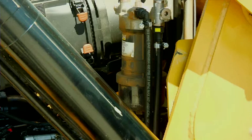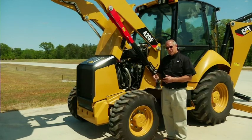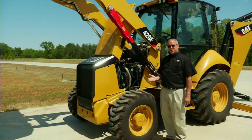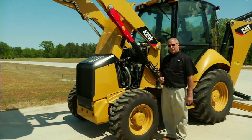and now the water separator's there and you've got easy access for draining the water out of the fuel system. In addition, we've gone with this engine with an electronic fuel priming pump. So now there's no more manual priming of the pump when you do your filter services. You can let that electric priming pump fill up the filter and make sure you've got clean fuel being served